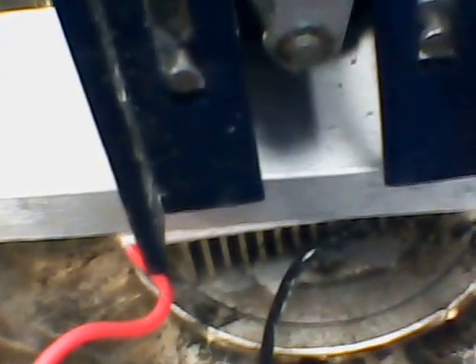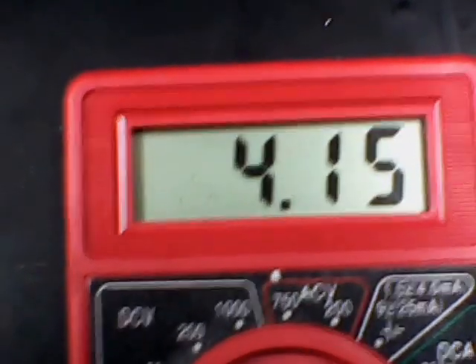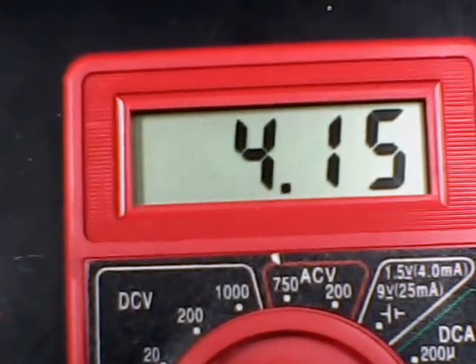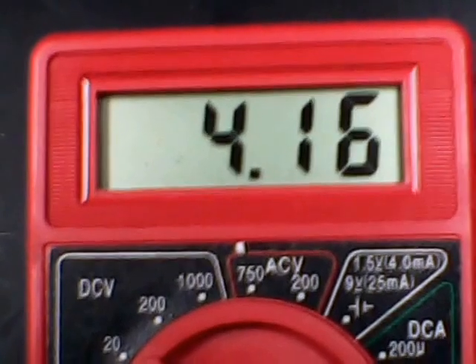Right now I'm at 135 Celsius, with ice water being pumped through. So if that's at zero, I've got a temperature differential of 136 degrees Celsius, plus or minus one degree. I have the TEG on a small computer cooling block — an aluminum block with fins — that's immersed in the oil, and the leads are running out to the multimeter. I'm at 4.1 volts, which is excellent, because my goal is to charge up 3.7 volt lithium ion rechargeable batteries.